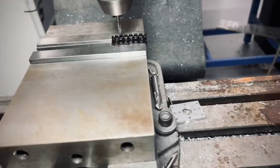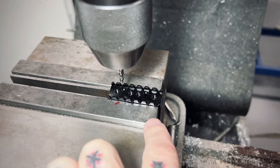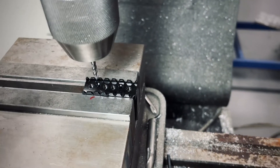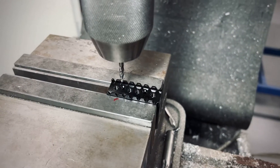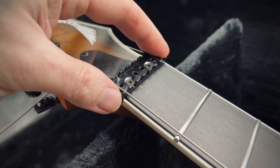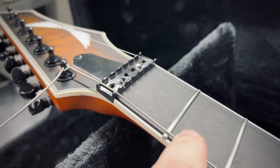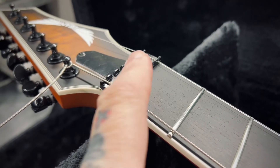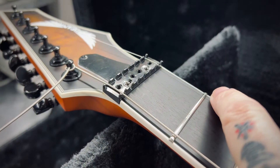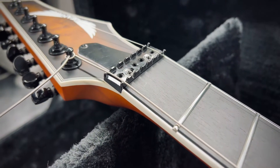I'm in the machine shop now. What I'm going to do is pull this hole over about a millimeter, and this other hole needs to go over 1.5 millimeters. Then we're going to bore the countersink in and it should be done. So I've slotted them and got it centered up on the neck. The nut is still a little bit high though — I'm at 0.8 millimeters on the high E and about 0.35 on the low E. So I'm going to mill it again on the back.